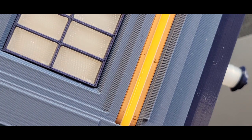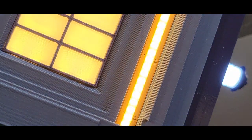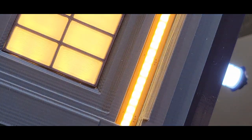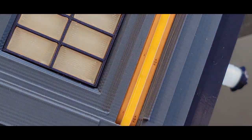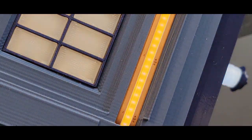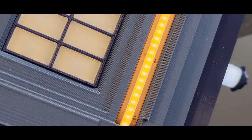So I'm going to touch the touch sensor to trigger a play cycle. If it's on battery power like this, touching the touch sensor or replacing the lid will trigger a play cycle. And you'll probably also hear some audio from it. That audio is pretty quiet. What I'm going to do is turn up the speaker. I don't think I adjusted that trimmer when I did the build, so I'm going to turn it up all the way and back it off about a fifth, so it's more impressive.